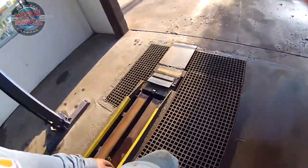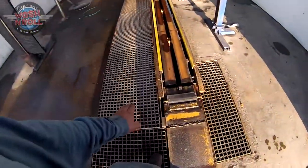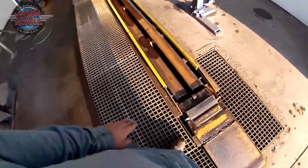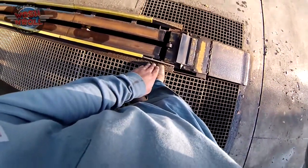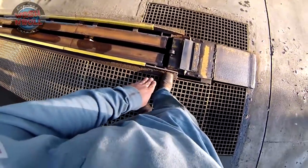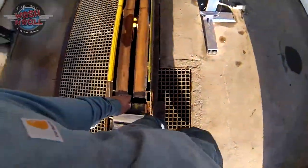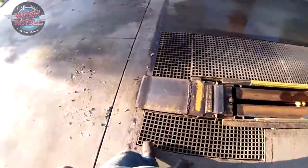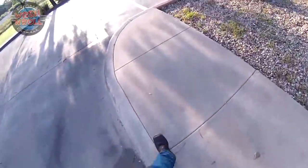The last item is that stores four, five, six, and seven have a soft drop trap door. Just like on the front end, there are going to be extended grease hoses right here, and there are grease zerts at the back end. Those need to be greased every week — two pumps here and two pumps there.